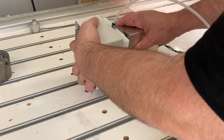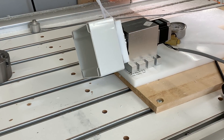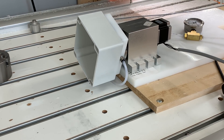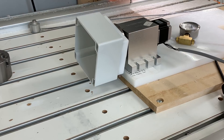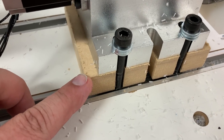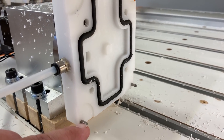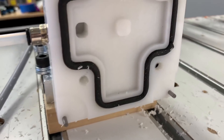Now we mount the box to it with the vacuum turned on — you can see it's really on there solid. I rotate the box 270 degrees, which is what it'll do when running the job, to make sure the airline doesn't get snagged anywhere. Then I zero it back out, rotating it in the opposite direction back to the start. I had to make custom spacers to get the fourth axis up off the bed so the corners of the box would clear the bed when rotating. Here's the vacuum fixture mounted, showing the alignment pins, the rubber gasket, and the vacuum inlet hole in the center.